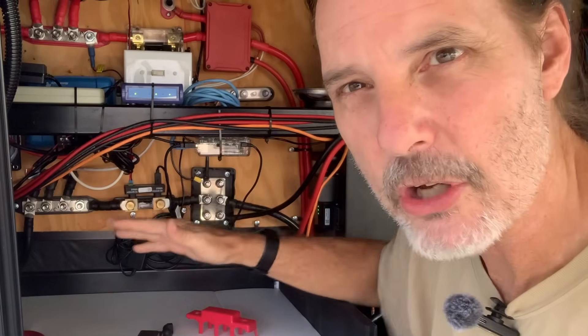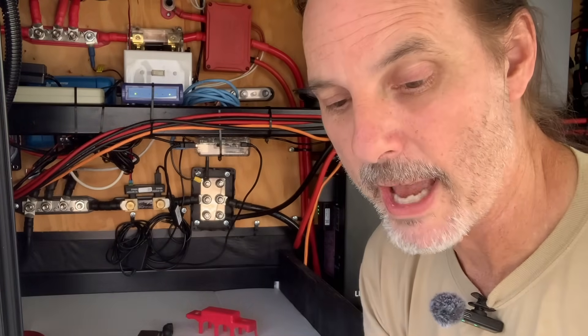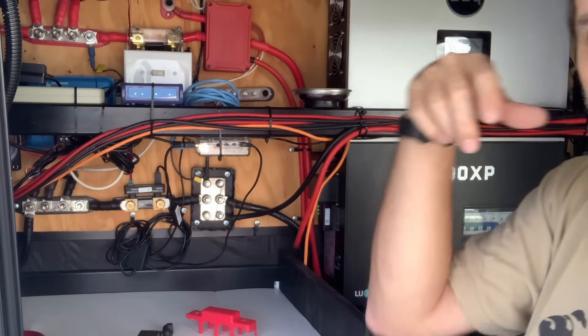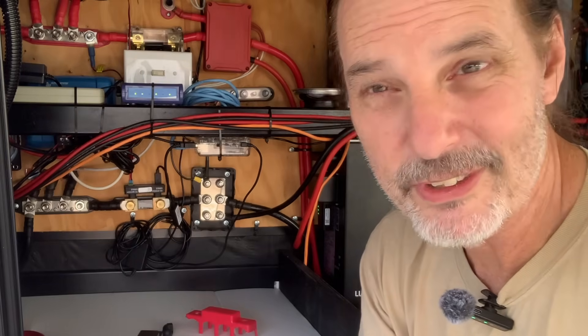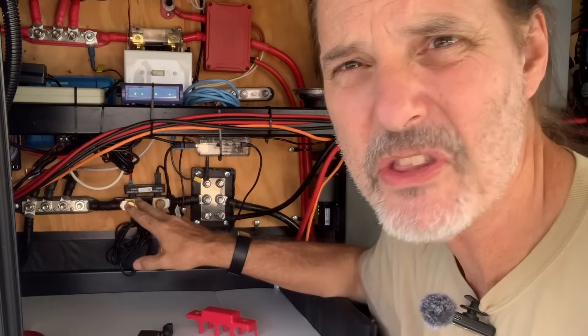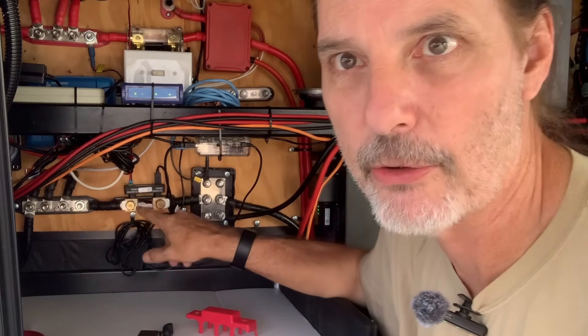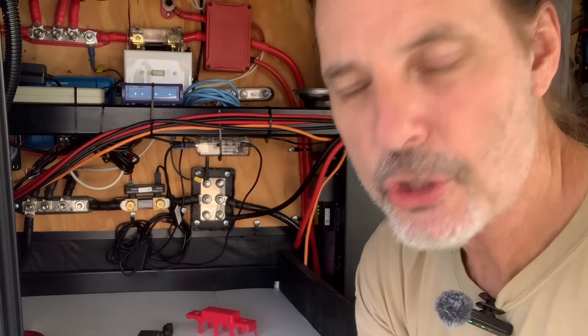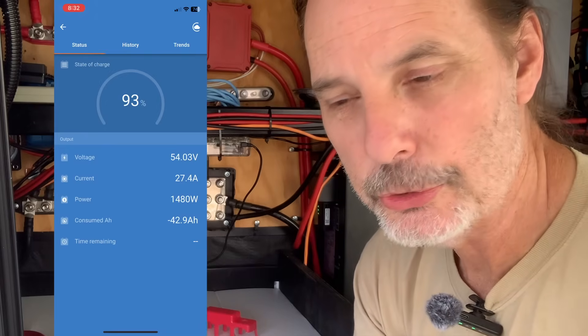It also measures current. Based on the voltage you'll know exactly how much current is flowing — and we're not talking about just one direction. It measures positive current going into the battery and negative current coming out, which allows it to very precisely calculate the state of charge across all my batteries: the DIY battery, the EG4 batteries, the 6000XP — however they report, closed loop or open loop. The state of charge from this shunt is the only one I truly trust. I've gone months relying on it and it remains the most accurate.